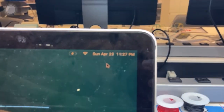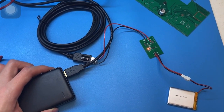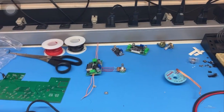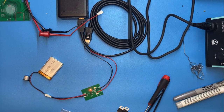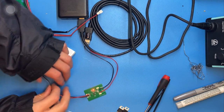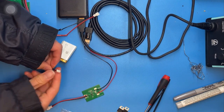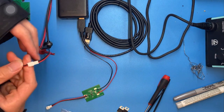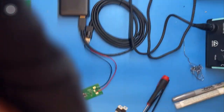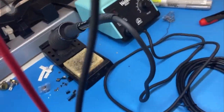This video is an example of our PCB for our charging circuit. We had a separate PCB for our actual design and that was not working, but as you can see from the charging circuit, it is working. At the beginning the time was 11:27 and we had a voltage of 3.8 volts on the lithium polymer battery. At the end, 15 minutes elapsed and we have a voltage of 4.0 volts, so we do get charging of the battery through our PCB charging circuit.